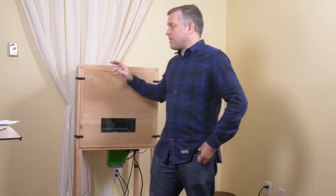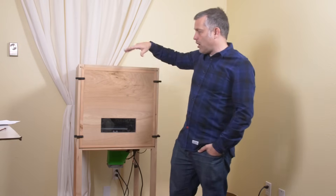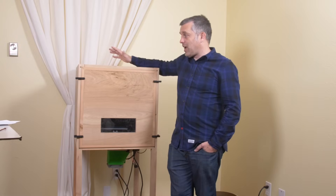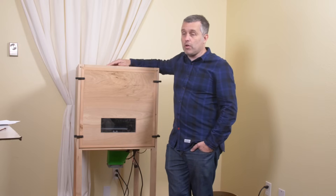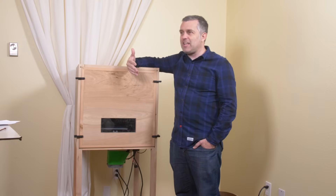I've got to redesign this enclosure for buildability. I basically didn't want to scrap the entire build, so instead of using polycarbonate windows on all four sides I ended up using sheets of Luan — salvaging the 2x2 construction. I don't recommend anyone duplicate this chamber exactly. A better approach would be polyurethane foam with foil backing from Home Depot or Lowe's — more temperature-resistant and even flame-resistant than wood.